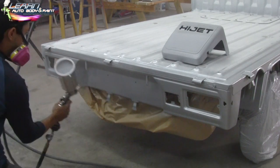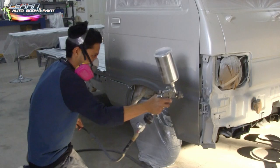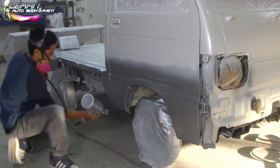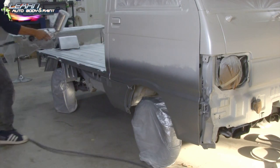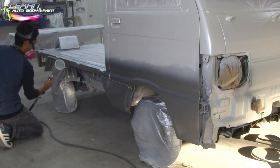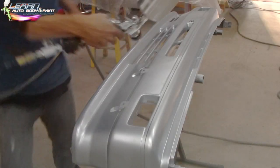That's why you see me testing with my hand all the time — I always feel the air pressure coming out. That's one way to test without looking at the gauge: by feel on your hand, and also by the tone of the air coming out. Once you start painting more, you'll be able to adjust by feel and by tone and know the correct air pressure without needing the gauge. If you're a total newbie you may not understand yet, but you will the more you paint. I've actually been using this method for over 15 years now.